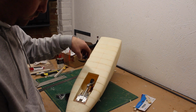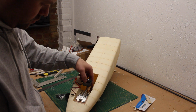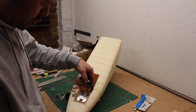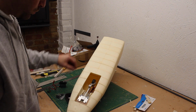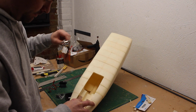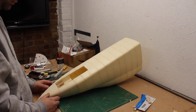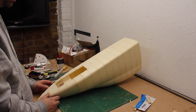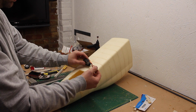I had a few ideas about where to mount it, including right beneath the gear, but I need to consider the pull-pull cable system and the space it needs to articulate and flex. I settled on a location slightly further rearward to give me ample room, and allow me to install the servo in such a way that it can be removed easily for future maintenance.